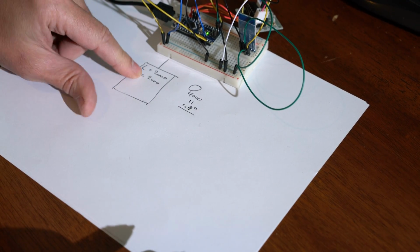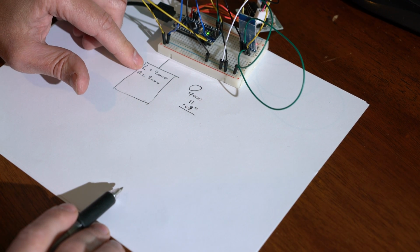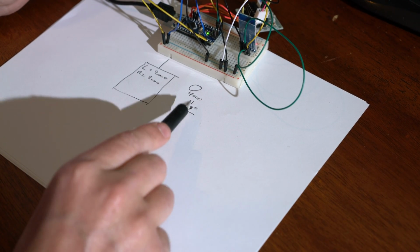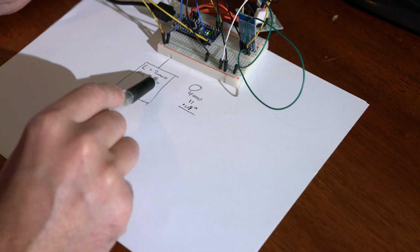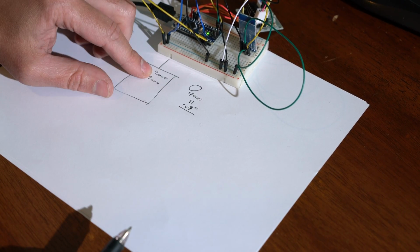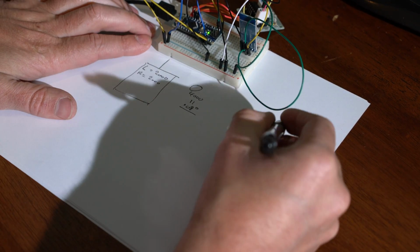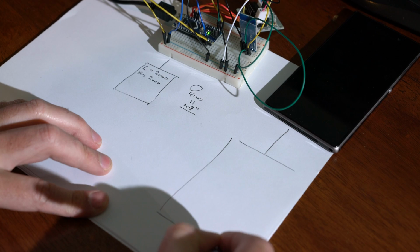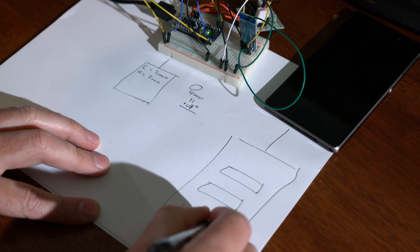So with the program, this is all inside the Arduino. If we change how much we want to move it, so if we want to move it 30 degrees, say, we just work out how many 0.09s we need to get to 30 degrees, and how many steps that was. We change this, so L would equal 30 degrees by how many steps it would be. And also, if we add more lines to this, and say we have our phone, and then we have some software in here, and this is where I want to get to really. So we'll just have, say, 3 adjusters.